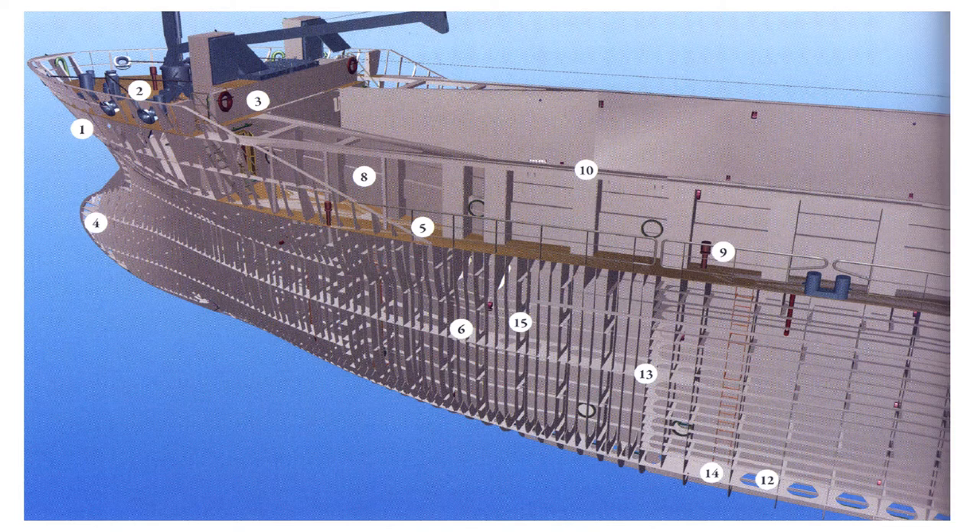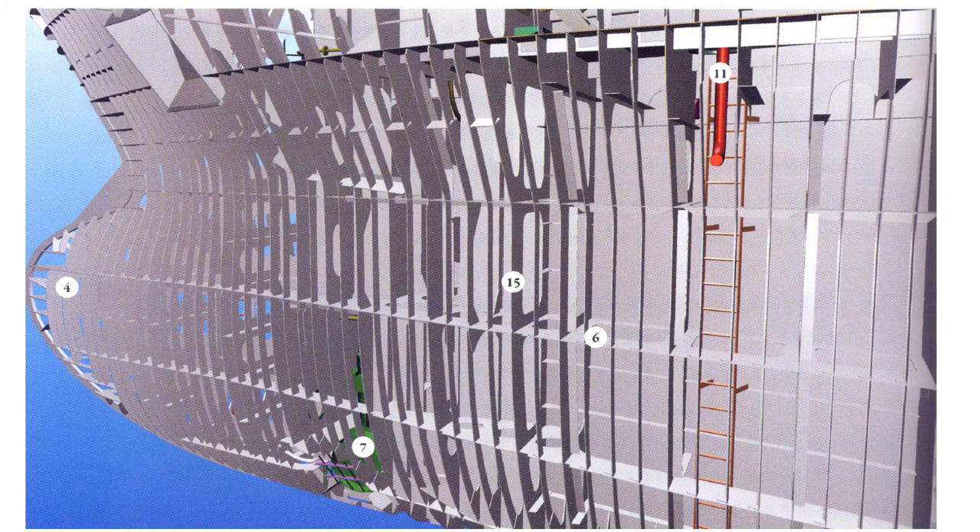The bow is subject to extra large forces, accelerations and stresses caused by the pitching of the ship — such as pitching stresses, the fore-peak moving in and out of the water which causes panting stresses, maintaining speed in heavy weather, as well as if the vessel is going to ice-prone areas where the bow is subjected to extra large forces from ice. Items stored in the fore-peak spaces need to be properly sea-fastened in connection with these acceleration forces. To compensate, the forward part of a ship needs additional reinforcements that sometimes extend to amidships.